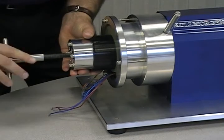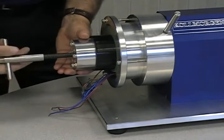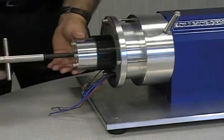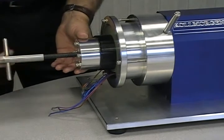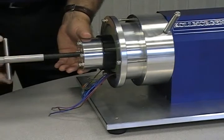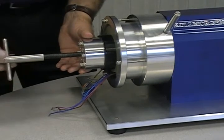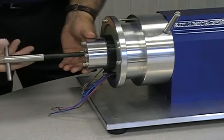At first, the screw will turn easy because there is very little attractive force between the rotor and the stator laminations. When the field and laminations come into alignment, the attractive forces will increase and the pressure on the screw will become much harder. When the rotor becomes seated onto the shaft, the screw will once again turn with ease.